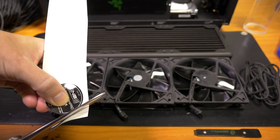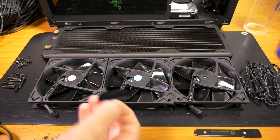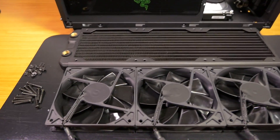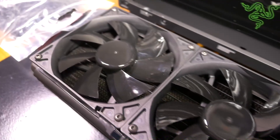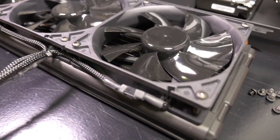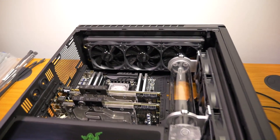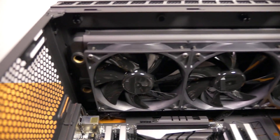If the channel is still small enough, it will hold the cable in position and you won't need any cable ties. With 120mm fans you don't need cable ties, but with 140mm fans, you will. Cutting the vinyl in a perfect circle is actually very difficult, so use the sticker to trace it out — stick the sticker on the back of the vinyl, cut it out, and when you remove the backing, the sticker comes off as well. So you get a perfect circle. The fan mods are complete. You're obviously not going to enjoy them in a push configuration, but at least the cables coming out of the sides of the fans are sleeved. I've completed the cable management for the radiator fans, which I always do outside of the build — you should always do as much cabling as you can outside your build for an easier process and better results.